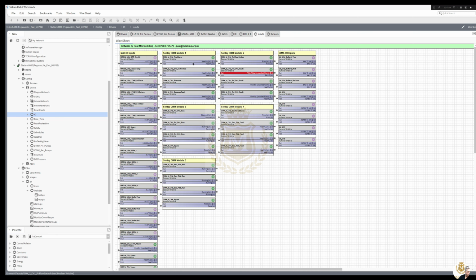These are my total inputs for the site, so that's your max 36 inputs. Outside air temperature sensor, space, which is actually the plant room space. The LTHW flow and return for the primary, the secondary. That's spare, that's the reason why it's minus 3.2, it's not being used.